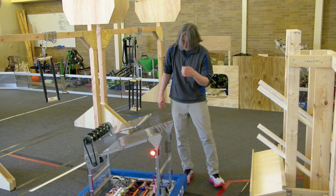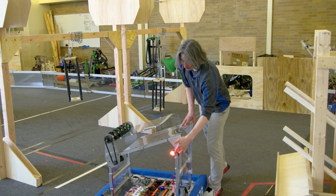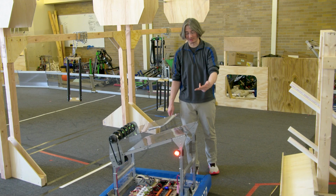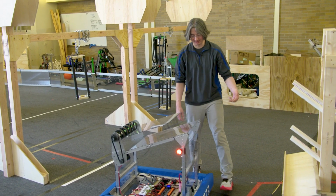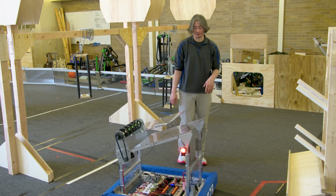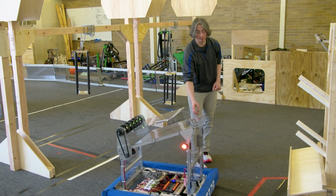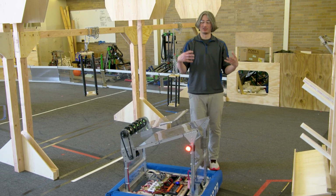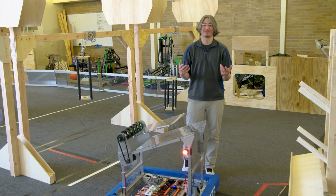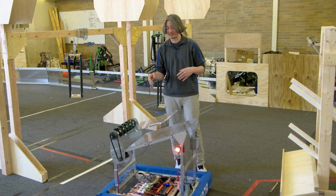And remember, if you need some of the space where some of the components are, like, hey, the robot signal light is in the way, this is a problem. Well, it's just 2 holes and 2 rivets. Drill them out, find another place to put the robot signal light, move it down here, move it over here, wherever you want, and reattach it where it's not in the way. Same thing with the radio. You can move the radio. The radio should be mounted, though, on one of these metal bars, because the aluminum will help heat sink the radio. The radio tends to heat up, so it's nice to have somewhere where that heat can get absorbed and spread out.